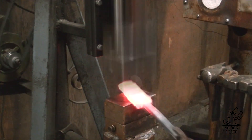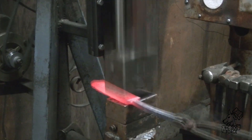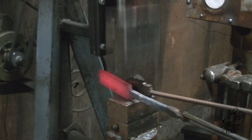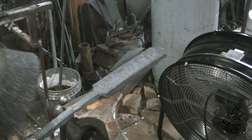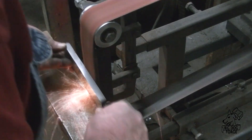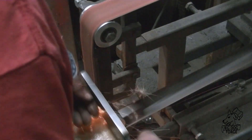By the way, I won't be mentioning the giveaway anywhere else — just in the middle of this video — so if you watched and caught that, you can enter yourself. Now we're going to grind the surface of this thing all the way around to get that scale off, then get it over to the belt sander and smooth it out. We're not going to go too far with it — probably 120 grit or so — just to clean it up so we can see the pattern in this thing.